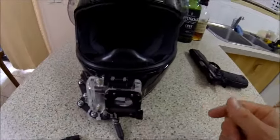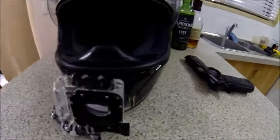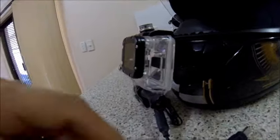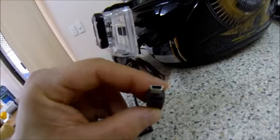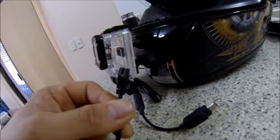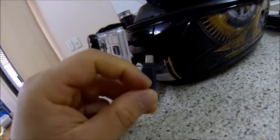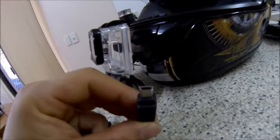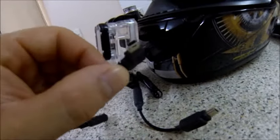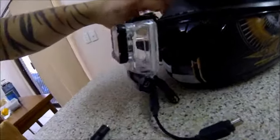For the housing I got a microphone adapter — a ready-made one — but I had to modify it because the plug doesn't actually fit the GoPro housing; it's a bit of a fat plug. The eBay special microphone adapter does not work because it's a 5-pin and GoPro uses a 10-pin plug. Apparently there's also a resistor inside that makes the microphone actually work, which the cheap one lacks.